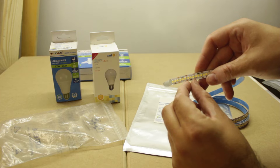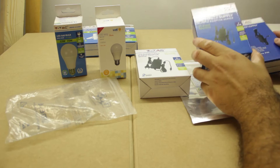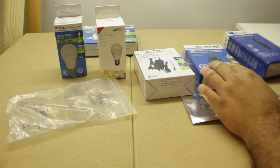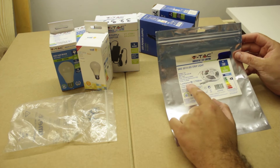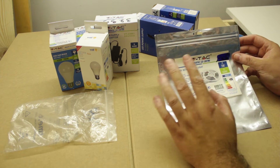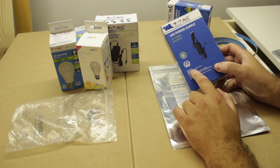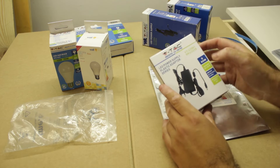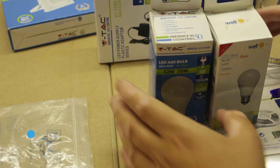Power supplies for LEDs come in various sizes — I've got a 42-watt, 60-watt, and 80-watt supply here. Since I need a minimum of 36 watts to run two meters of strip, the smallest I'd take is the 42-watt unit. You should always oversize your power supply — a 60-watt or 80-watt supply is perfectly fine and will deliver the 36 watts without any problem.